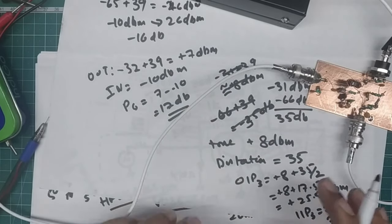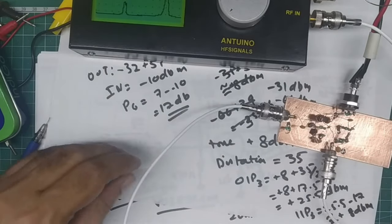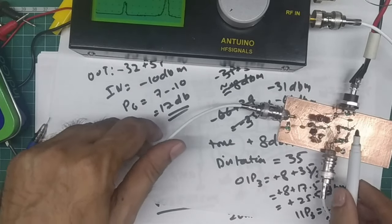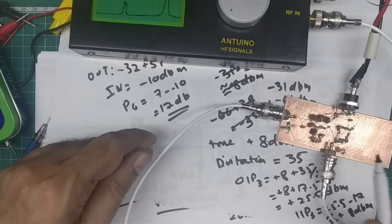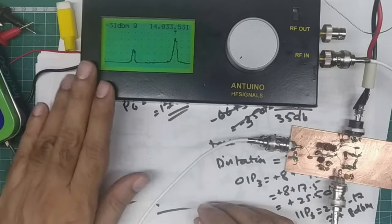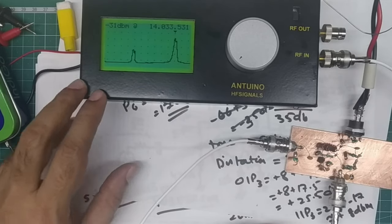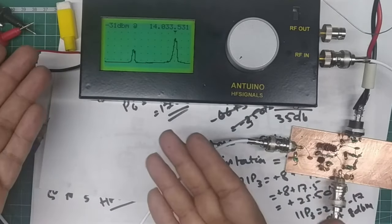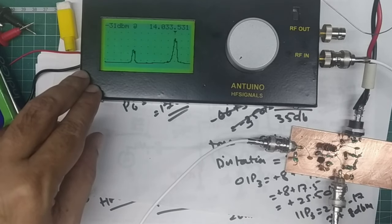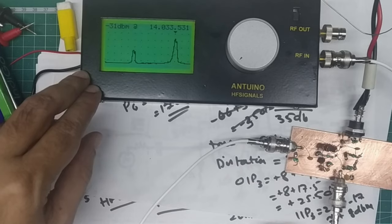With this, we've fully characterized this amplifier — its gain, frequency flatness, input/output impedance, and OIP3/IIP3. We know exactly how it will operate whether dropped into a transmitter or receiver. The Antuino is available for $100 at hfsignals.com, but I encourage you to build it yourself — it's based on an Arduino, an SI5351 (available from Hans at QRP Labs), and about two transistors. We'll deal with other uses of the Antuino later. 73 and have a great time.